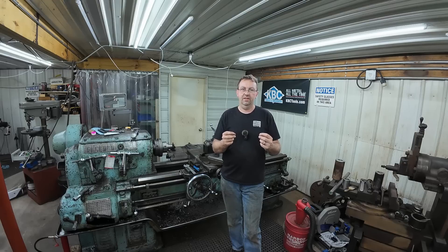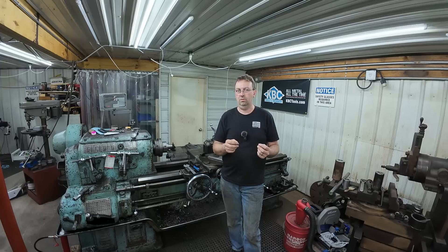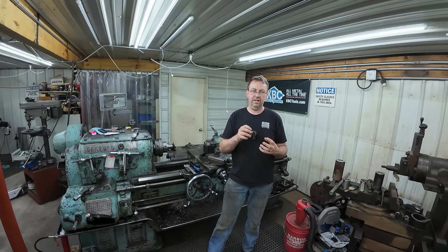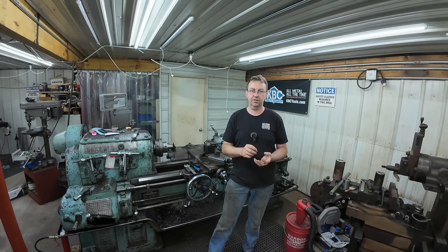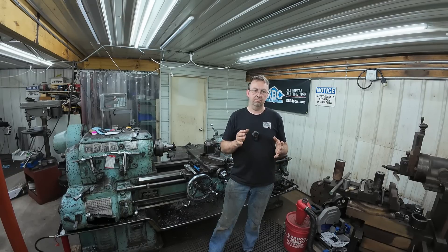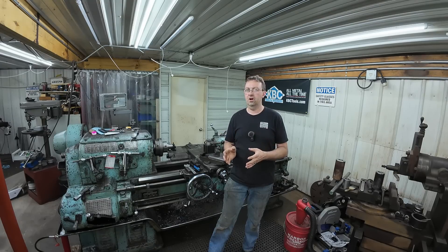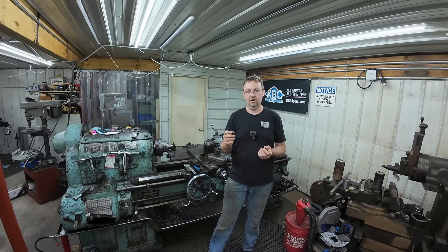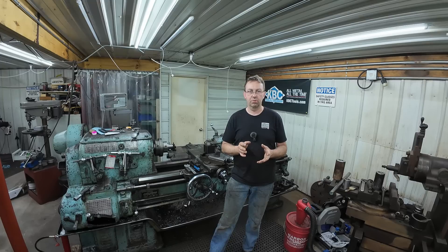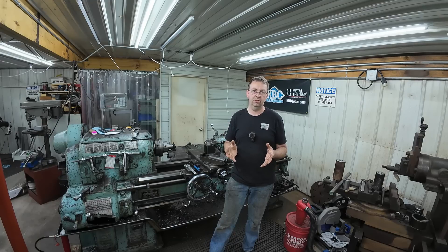I had a lot of feedback on that — how I probably should have welded it up and repaired it. No, I will never do that. That introduces new stresses into the material and creates potential brittle points and fracture points. In the last 25 years I've been in this industry, I've seen about a dozen of those come in snapped off because they were welded. I've done over a hundred where we've just taken a little bit off, heated up and slipped on a bushing, then machined that bushing like I did in Saturday's video. I have never had one come back broken — not one.